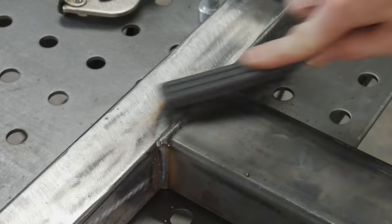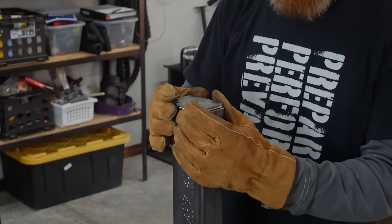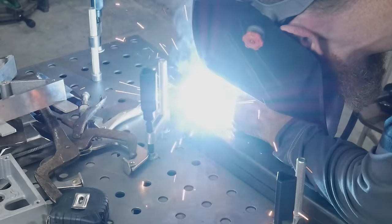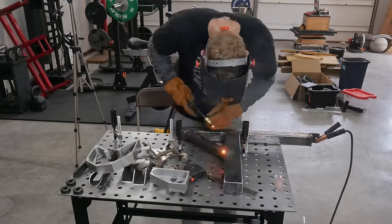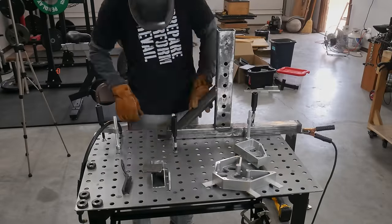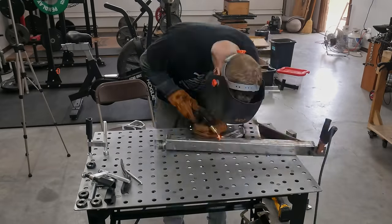I'm putting quarter-inch angle iron tabs on the end of the feet with holes so that if I ever want to bolt this press down to the slab I have easy mounting holes already there. I can see my welding machine is really dialed in - this weld is probably the best I've ever done with this MIG welder. I ended up putting a quarter-inch cap on the top of the feet sections, and added 45-degree angled supports from scrap steel.